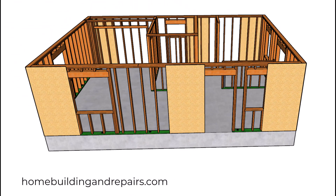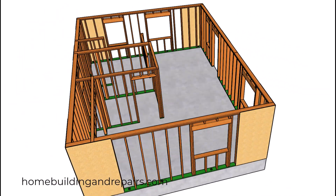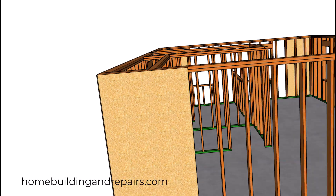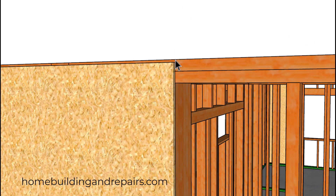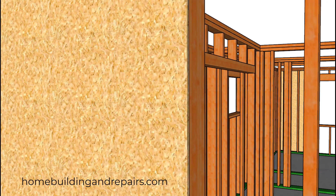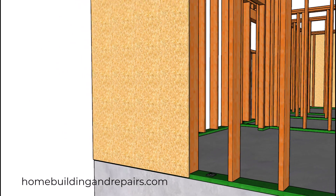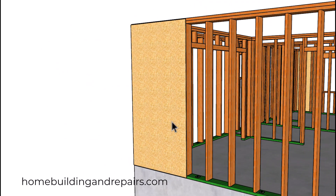Let's go ahead and go to the front side and the back. Before I end the video, I just want to point out that you can see where I lowered this a little bit. That's because our standard wall framing stud usually produces an eight-foot, one-inch tall wall, suggesting that you're going to need to lower this a half inch and raise it up a half inch at the bottom. For 6-and-12 nailing, that shouldn't be a problem — something like this should work just fine, and it is actually a standard construction practice.